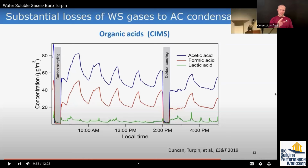So when that happens, that's nice. If we could have that happen as long as possible, that's better. That's a better sink. It's an extra filter for your home that you do not have built into your home, because filters for HVAC, even if they're HEPA filters, don't pull water soluble organic gases. You need water to do that. And so your AC coil becomes, at that point, a filter that literally throws itself away. You don't have to change this filter or anything.